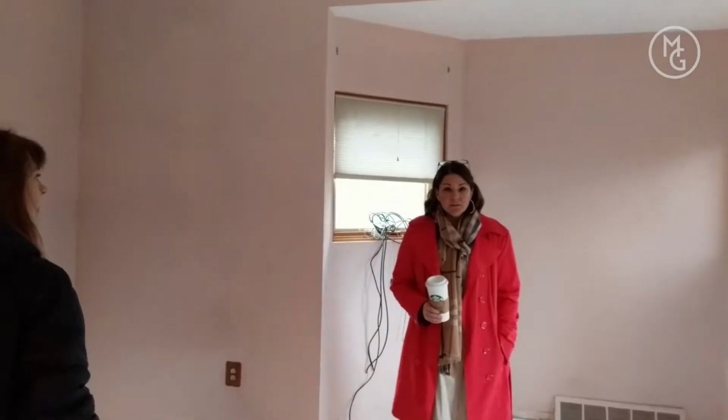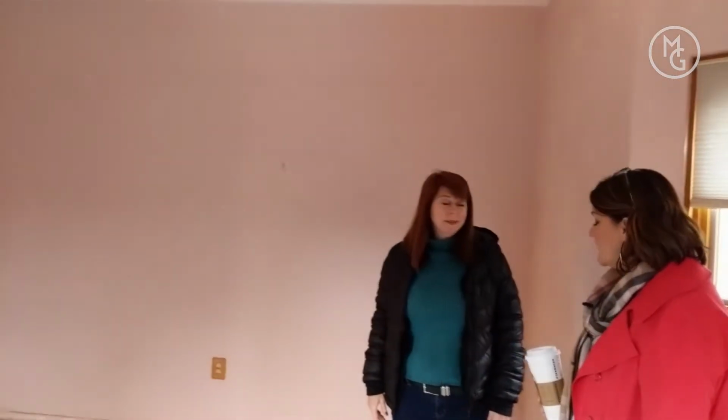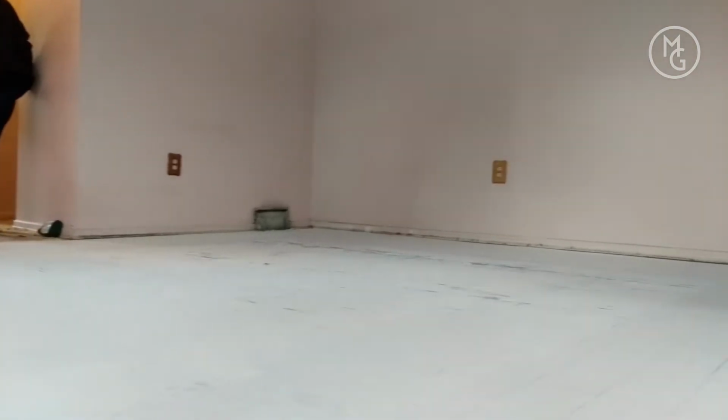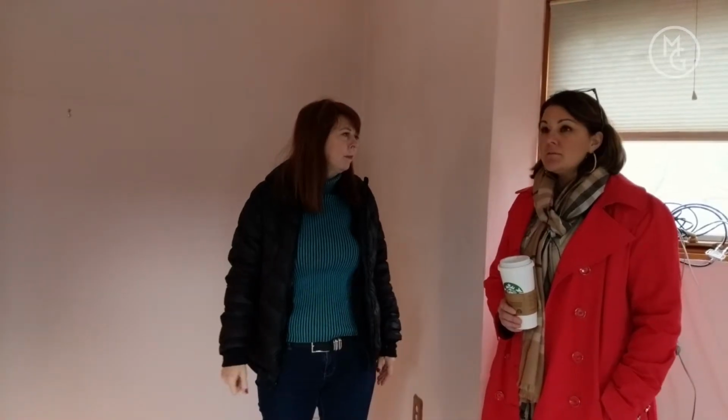So this was the living room, and this was the worst room in the entire building, smell-wise. How do you deal with that? Well, the first thing we did was take out the old carpet, and then there was a rotten pad underneath that was still stained in there. So we scraped that off and shop vacked it. We had to pull out all the tack strips and all the staples, and then we poured an enzyme cleaner over it, which is supposed to be more effective than working with just bleach, and it really made a tremendous difference. But since I can't salvage the floor, we then finally sealed it with oil-based Kilz primer, and that's supposed to lock in whatever scent, so if it got wet in the future, it won't come back out. Yeah. It does smell 100 times better. I know you can't see that on the camera, but smell-o-vision is much better here.